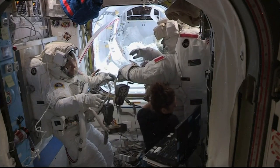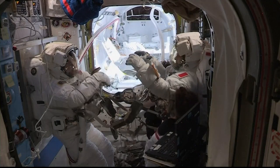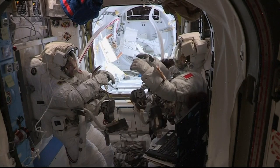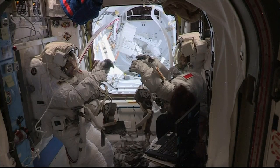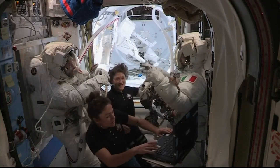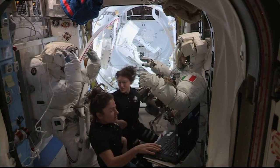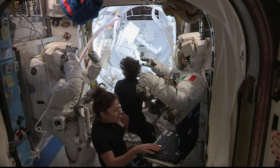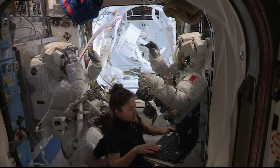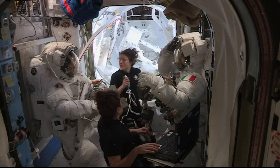The new pump system is called the UTTPS, the upgraded tracker thermal pump system. That pump system was carefully brought out to the worksite, which had been prepared on the previous two spacewalks. A lot of intricate work was done during today's spacewalk. That included installing the new box, plugging in the power and data cables that were previously routed, and clean cutting the tubes that were previously rough cut, and then swaging them with an alternate fitting, essentially connecting them to the new pump system's tubes,